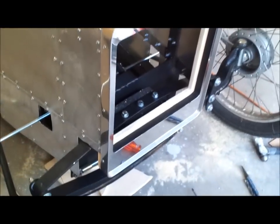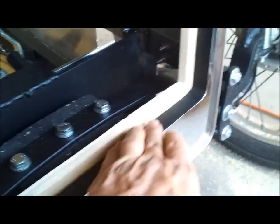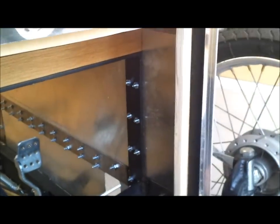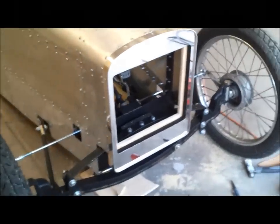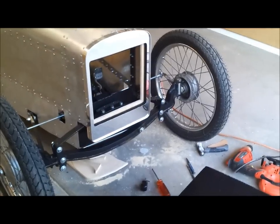I finally finished installing the radiator and I'm really happy with the way it turned out — it fit the front end real nice. Through the opening I cut, I was able to reach in and screw it from behind. The same opening will let me put in the side panels. I left a half-inch section of plywood all the way around, and that's where the honeycomb will fit in flush or slightly recessed — I'll probably paint that edge black. The idea that the whole front section would come off got modified — now it's just the honeycomb that comes out. If this thing ever gets beat up from racing around, I can relaminate, repolish, and put in a new piece of honeycomb, so there's no reason I can't keep the front end looking good.